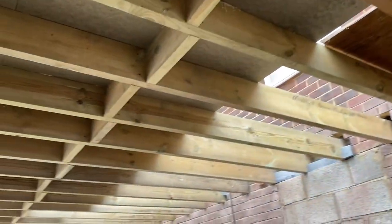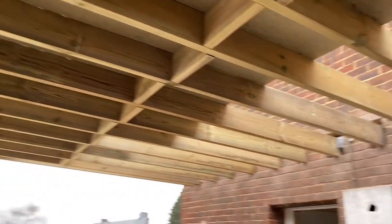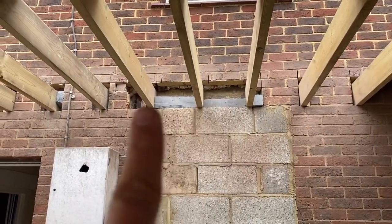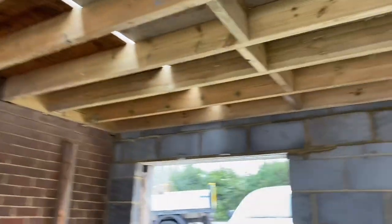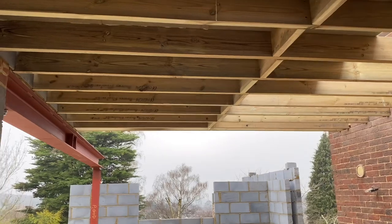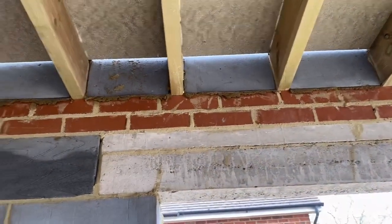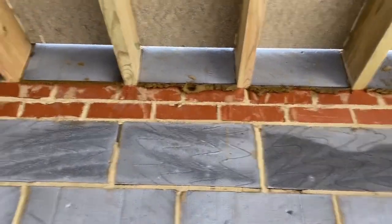All right, it's flooring. Just going to brick these in now, get them in, hugged in, so they're all sturdy. That's noggins gone through the middle, should be every 2.4 meters or in the middle. And then beam fill, or block fill, is that there — and then they don't go anywhere, sturdy.